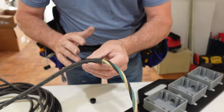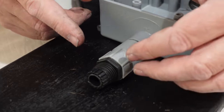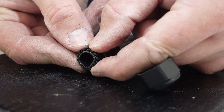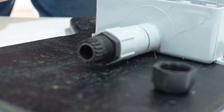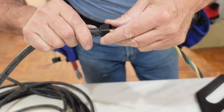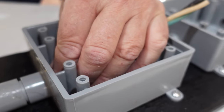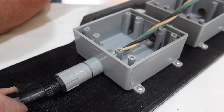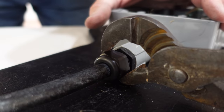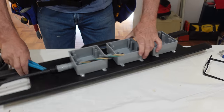We got the sheathing removed using the same method we did on the GFCI end. Now it's time to put it in this strain relief. See all these fingers around the perimeter? Inside is a rubber sleeve. When this nut is threaded on, it's going to compress these fingers against the rubber sleeve, and that sleeve is going to bite into the sheathing and form a tight waterproof seal. First thing is to put the nut on, then push the cord through, get the nut started, and tighten it with channel locks — about a quarter turn. That is solid. Now we're ready to start running some wire.